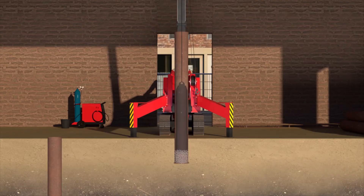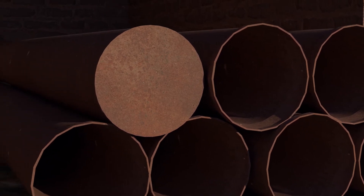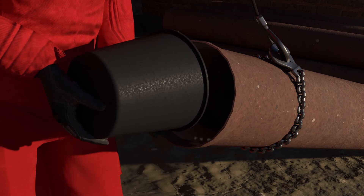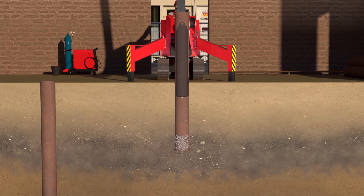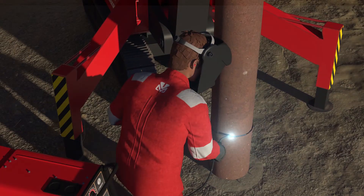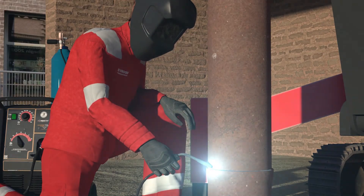The casings are driven into the ground using a ram inside the casing. The first segment of the steel casing pile has a welded foot to seal the casing. Gravel at the bottom of the first segment helps to transfer the impact pressure to the casing. Each segment that follows is inserted into the previous one and welded together. The seam is then welded together to form a watertight seal all around.